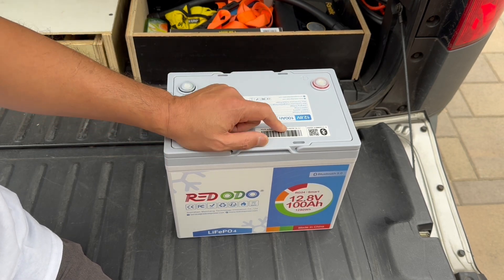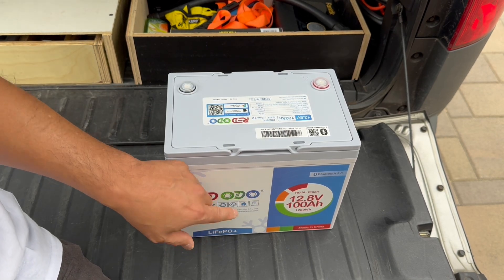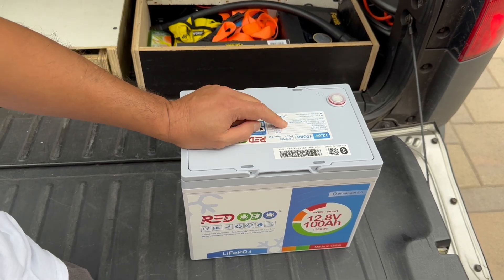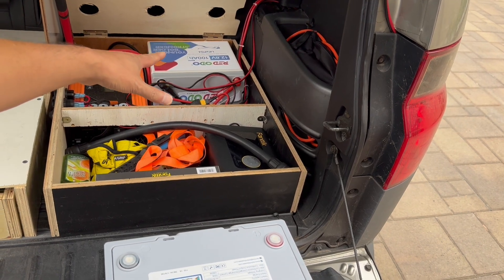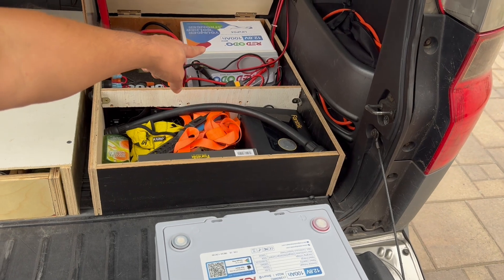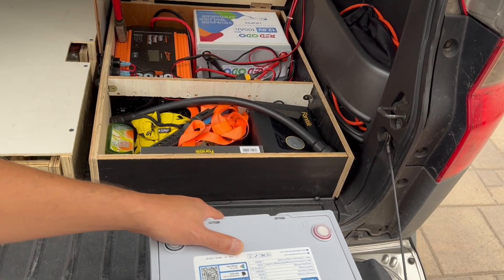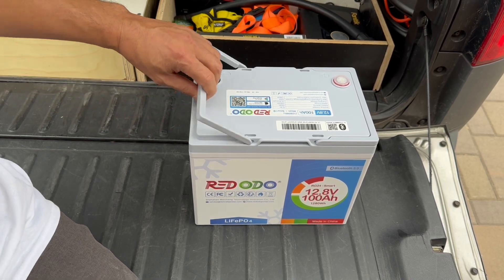The physical battery monitor actually worked well, but you had to calibrate it and things like that, so it was a little bit cumbersome to install. But with this one, there's an app that you can use to monitor your battery level, so you don't have to do any of that installation. Also, in this camper I do want to put a microwave in it, so this battery can handle a bigger current spike than the mini battery. That's important if you want to do things like microwaves. Because they were doing some things for size, the mini did have a few less features, so the capacitive load on that is a little bit lower. What happens is I have one inverter that actually doesn't work with that battery — I think it has to do with the capacitive load pre-charge on the BMS, so it would just overload right away. But this new battery should not have that problem at all.